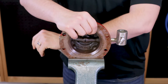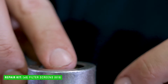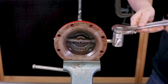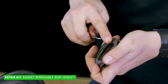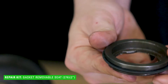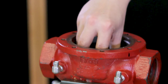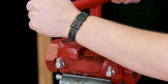With the valve fully disassembled, now is a good time to organize your workspace and open your Kimray repair kit to prepare for assembly. Clean every part and clear all debris using a wire brush or a rag. If you're in a shop, you can use a parts washer; if you're in the field, you can use degreaser. With the upper housing in the vise, replace the filter screens from the repair kit — this is easiest with the rounded edge of the filters facing down. Put the new O-ring on the cap, then reinstall the cap into the filter body. Put the body back in the vise. If you were replacing the removable seat, place the gasket from your repair kit on your removable seat, being careful not to apply too much pressure on the gasket while installing so it doesn't tear. Apply grease to the gasket and to the sealing surface in the body. Install the removable seat into the body with the Kimray Seat Removal Tool. Do not over-tighten the seat, as this could also cause damage to the gasket.